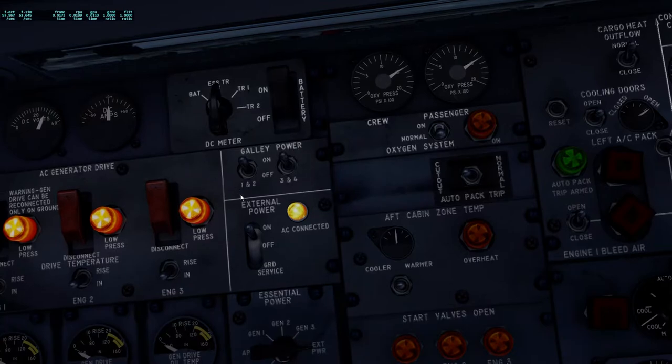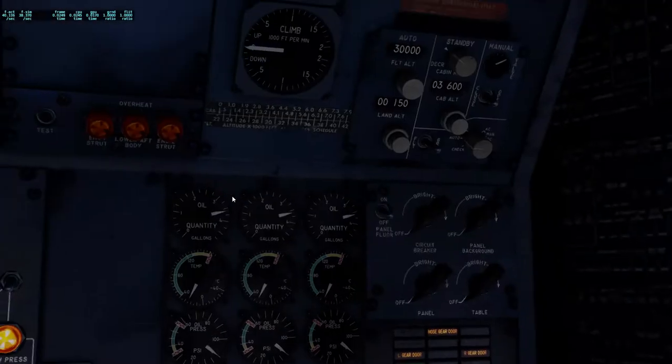Okay, again, fuel dump panel, make sure it's checked. So you can set our flight number here. Today it's 12. Set 12. Everything here is normal and checked. Exhaust temperature is fine. Amperage is fine. I believe, yes, it's shared with the GPU, so that's the amount of amps the GPU is using.